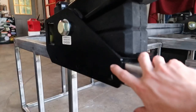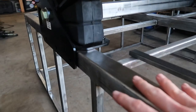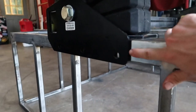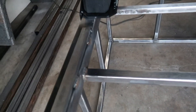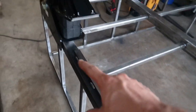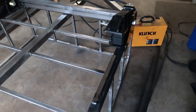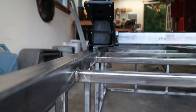I was thinking of re-drilling holes, but then I realized this is a half-inch flat bar — it's an inch and a half from here, and the half inch will offset and center it up. So what I'm going to do is weld some half-inch flat bar to the bottom of my frame for the timbrens to rest on, and that will space it up just enough so the holes will be dead center in our 2x2 bar. I went ahead and welded that half-inch flat bar in place on both sides. I also painted under where it was going to rest and the bottom side of that flat bar, just to keep that surface nice and sealed against moisture.